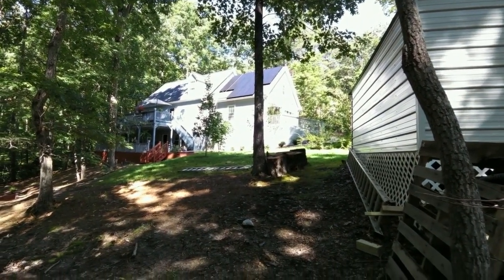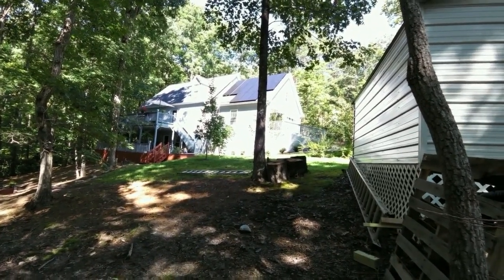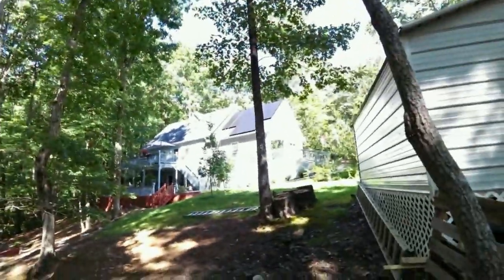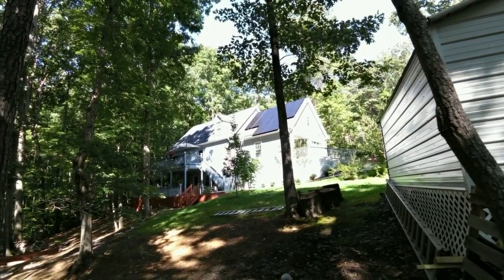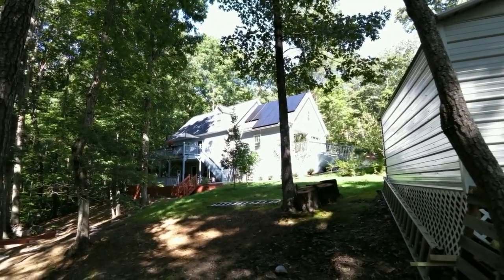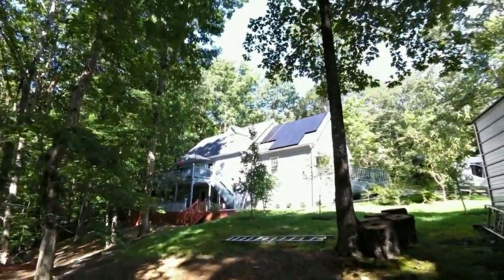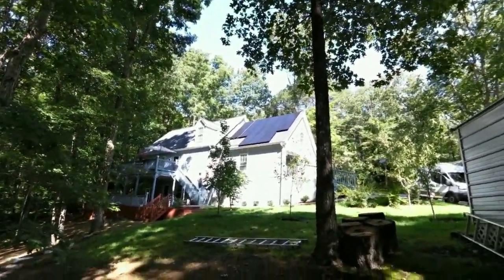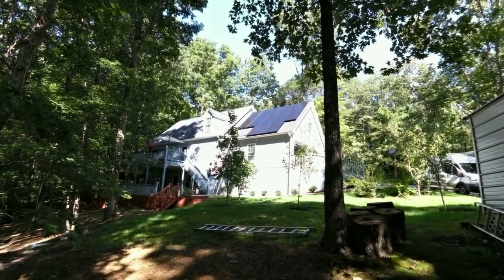Good morning YouTube. Johnny Valentine here with Gain Solar. I'm out here at a secure location — dusty times where I'm working. Putting in a 4KW backup power system. This is 15 panels wired in strings of three on an Outback FM80 charge controller and an Outback Radian.